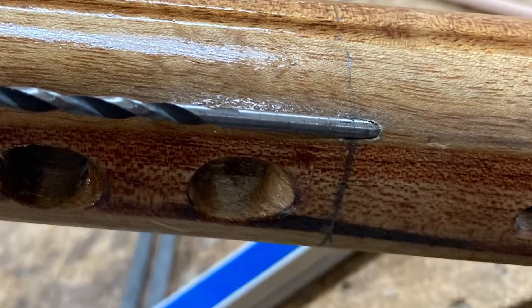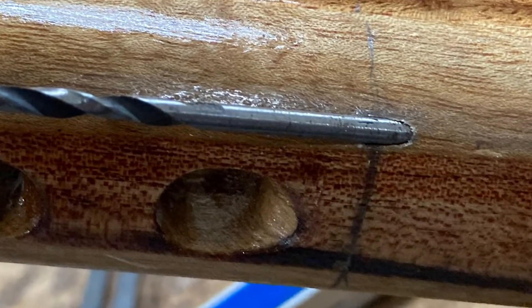I did a test fit with a drill bit and the angle was right — correct angle, correct depth, nice clean edges, and the hole in the position where I wanted it. The jig's a success. Now all I've got to do is cut the pin from a piece of rod the right length and hammer it in.